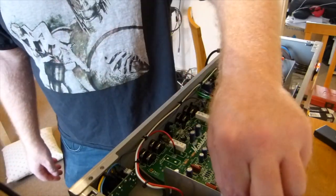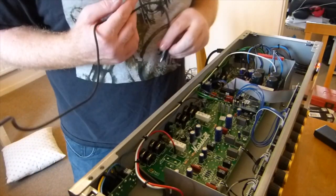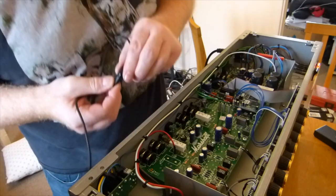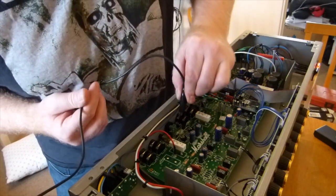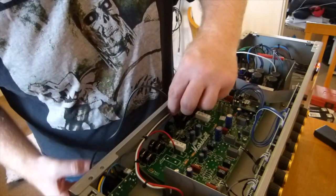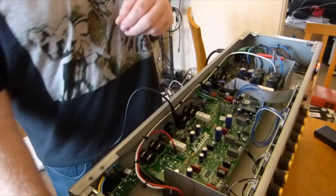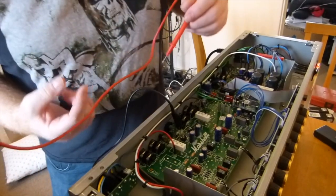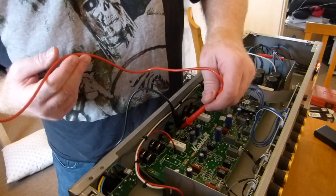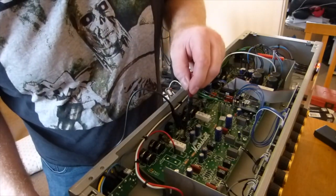Maybe we'll just try that, go up to maybe 35 on the side. It's worth a try. This amp does not get used hard. In fact, I rarely go very high in the master volume anyway, it's mostly used at home. There we go. Back on con one, pin 3. Keep saying con 3, that's something else. Back to 200 millivolts DC. So we're at 33, aren't we? So let's give that a tweak. Little tweak up.